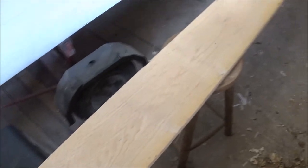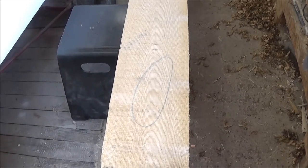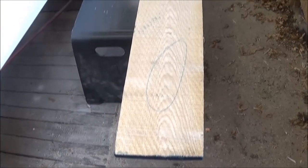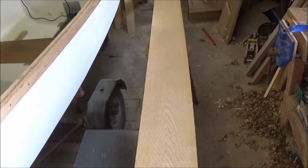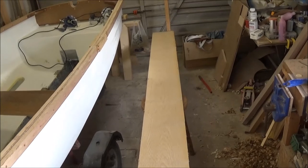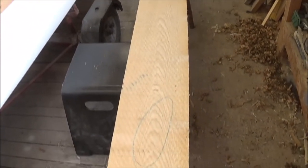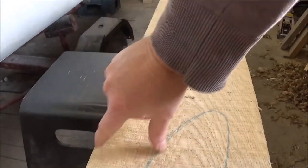If you know anything about the way wood is cut, this is a plank from a trunk that's been sliced through and through, horizontal with the ground. So it's not quarter sawn, it's slab sawn. We looked through a load of planks like this and they're all the same. I imagine they take out the quarter-sawn slices between three and nine o'clock, apart from the heartwood, and put them to one side in America, maybe.